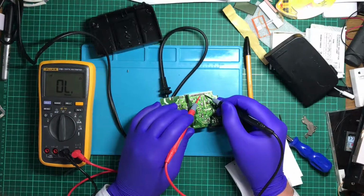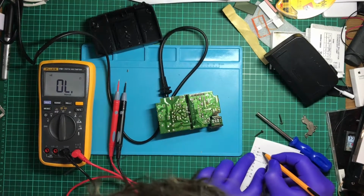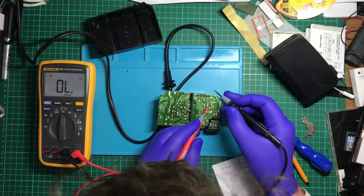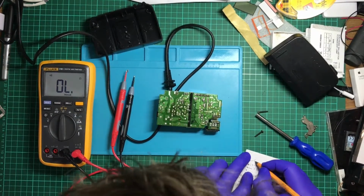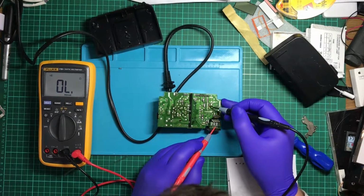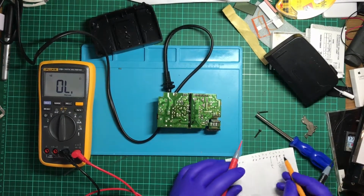So I'm not seeing any resistance with that. All right, so we've also got 3.3 volts there. Now I know that this is ground. So this is GND. And just to be double sure about that, ground. Okie dokie. So I've been able to pin out, so what about pin 12?